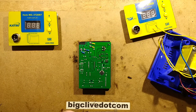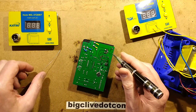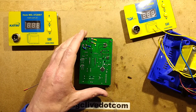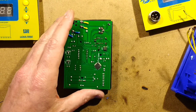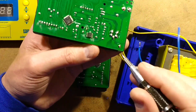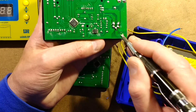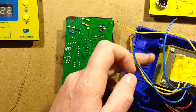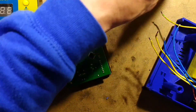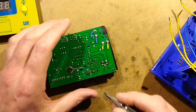All you're really going to need is a bit of wire. I've got my typical equipment wire and I'm going to put a bridge between each of these solder connections and create a new pad by scrubbing here. I've already taken my own circuit board out of this, noting that this is deliberately flowed onto the side here to strengthen these pads - worth noting. You can lift it out and solder onto it in situ, which saves disconnecting all these wires.